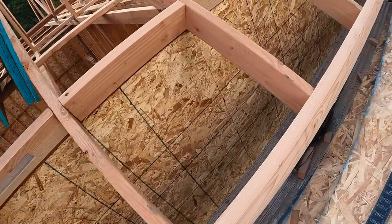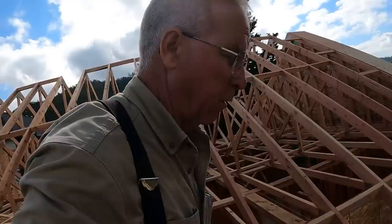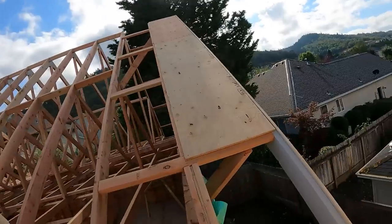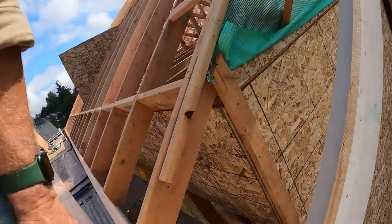So this would ordinarily be considered a subfascia, because that kiln-dried Douglas fir is not the same material as this S3S spruce, which is pre-primed and is used for fascia and barge rafters. But the reason I'm using it is I'm using a fascia gutter. I mentioned that earlier back when I was reviewing the plans, I think. And I was going to hang the fascia gutter right on the end of the rafter tails, which is reasonably legitimate if you're using 5/8 roof sheeting.